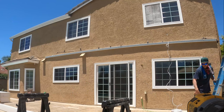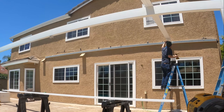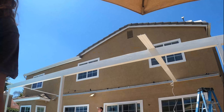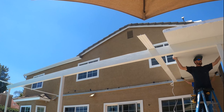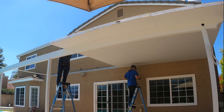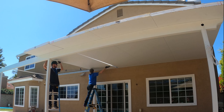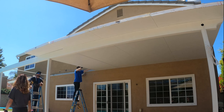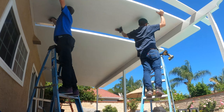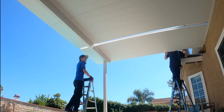Doing the side plates and getting the beam flipped over — I'm going to give it the same overhang on each side and basically strut it before I put up the panels. We're getting up the first panel. Here's really where the builds can either go right or wrong — you really want to make sure those panels are installed properly, sealed in between, and then locked together right. It's sometimes the quickest part of the job but everything leads up to this moment.